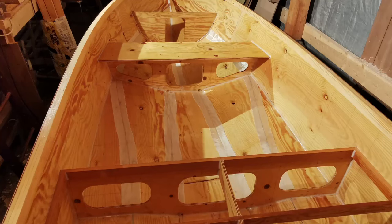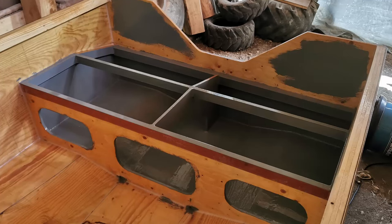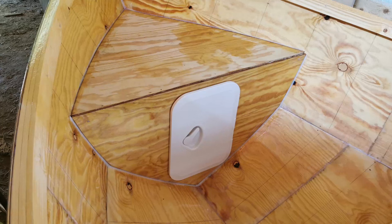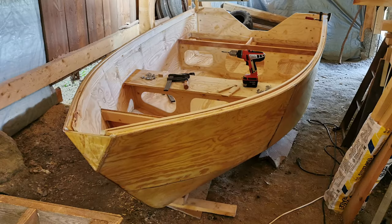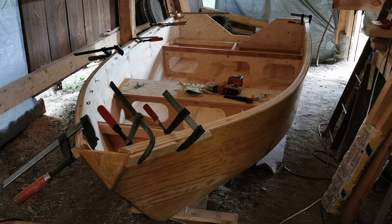I added fiberglass on the joints on the inside of the hull as well. I started painting the aft compartment before gluing on the seats as it would be very hard to reach otherwise. Here is the waterproof door for the front compartment — as I didn't want to screw into the plywood I just epoxied it into place. For the railing I used thin spruce planks and glued three of them on each side. I put the railing on the inside of the boat as I think this gives the boat a very sleek look.